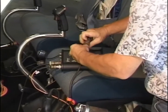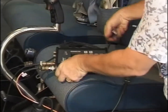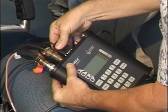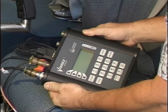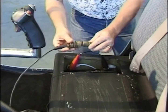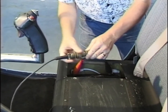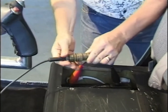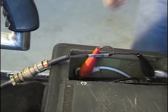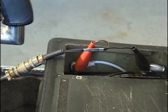The Strobex is attached to the Vibrex 2000 via cable 13797. This cable is then attached to the Strobex 135M-12 and the aircraft 12 or 28 VDC supply. The Strobex will operate on a charging 12 VDC bus — that is, one with more than 12.5 volts DC.